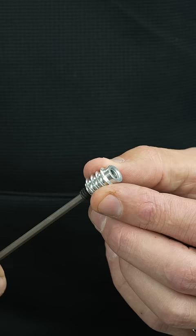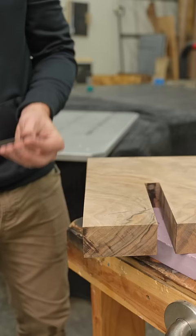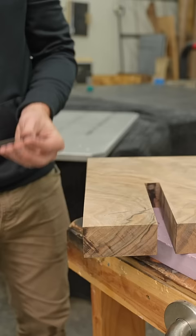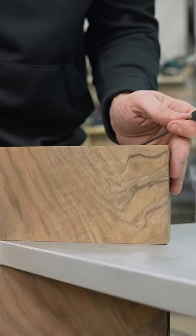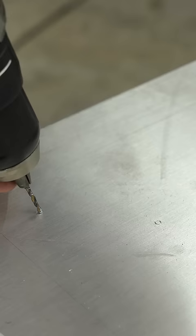To figure it out, this is what I came up with. Since the wood would have been able to just be glued in, and I didn't want to glue this shelf in, I added a threaded insert there, and this set screw is going to be what holds it in. Set screws are used to hold giant tools together — they are very, very strong.